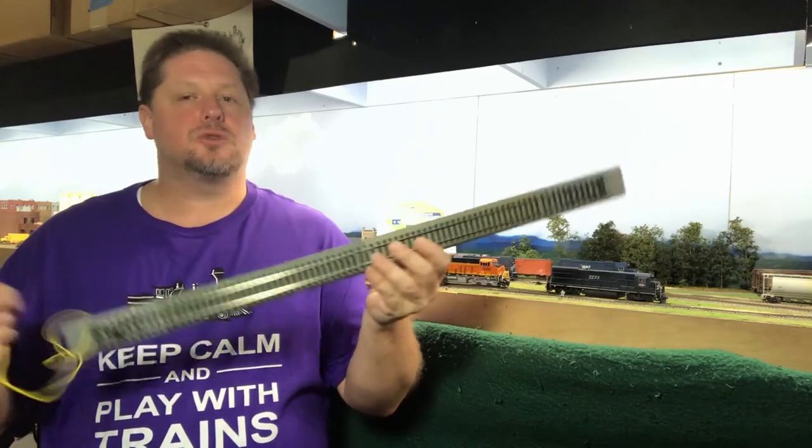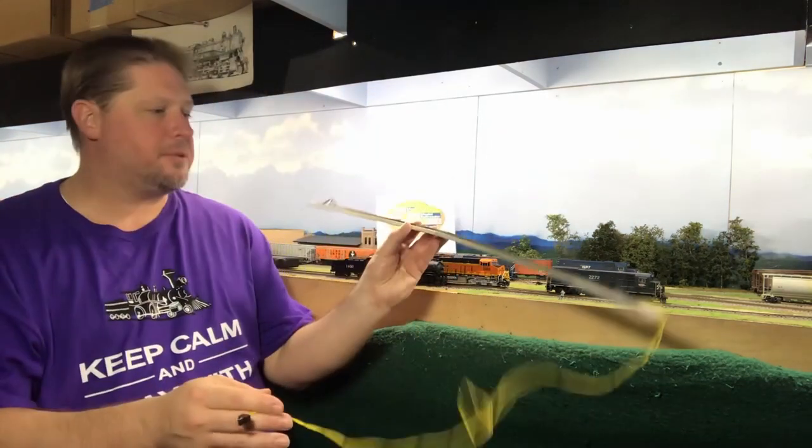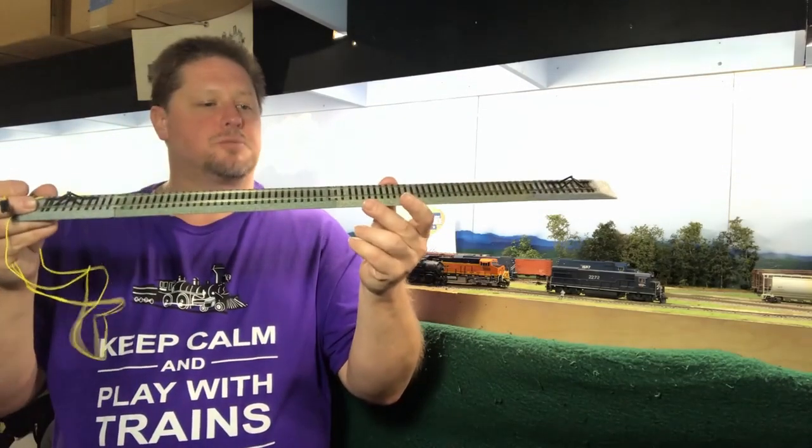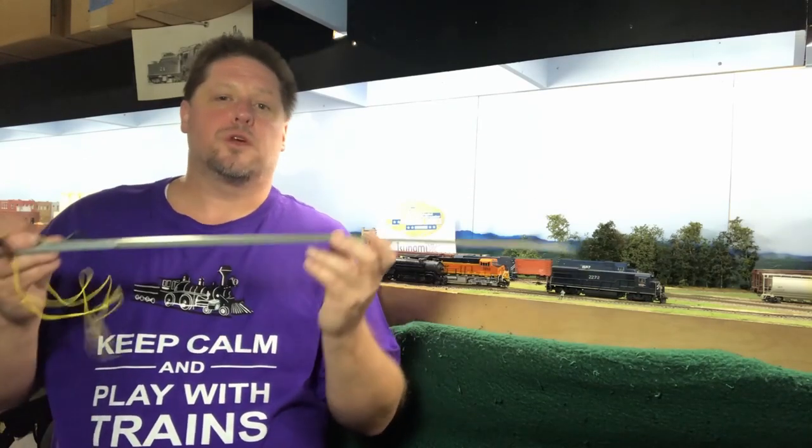So what I can do is I get from NCE the little two-pin connector that you can get and plug into the back of the power cab. So what I'll do is I'll set this on top of the layout, plug this in place of the track power, and that creates a small isolated programming and test track that I can now use with my power cab